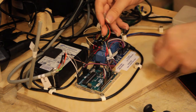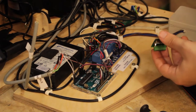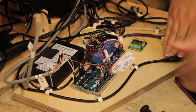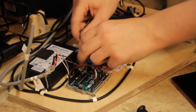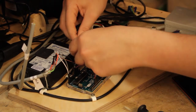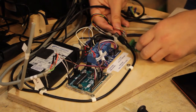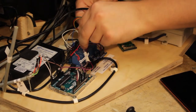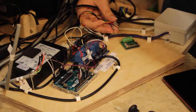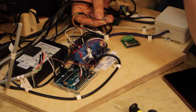We need to find a good spot for the new stepper driver without lengthening all the cables. I would put the stepper driver here where these cables can come around quite easily, though the power cables are probably going to have to be extended. This is not the last project where I wish I had put in some power rails for distribution of the 12-volt stuff — I didn't. I personally would have recommended putting this onto a PCB.